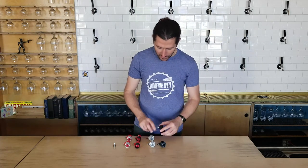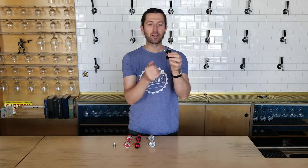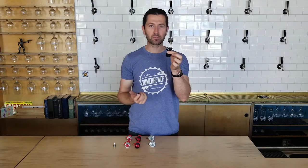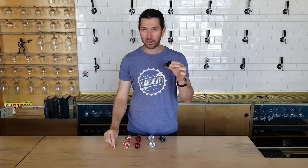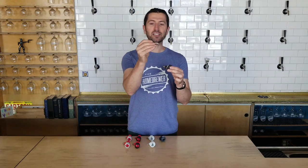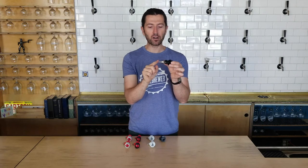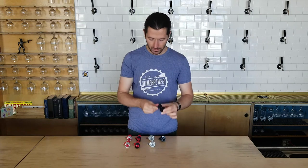The other big thing is that you have a barb connection versus a flare connection. A barb connection is pretty straightforward — your tubing is going to go on there and you'll put a clamp, and you're good to go. A flare connection uses a type of thread fitting that we call flare, and you can put on these flare swivel pieces and actually change out the size of the barb depending on if you're using gas tubing, liquid tubing, or whatever you need.